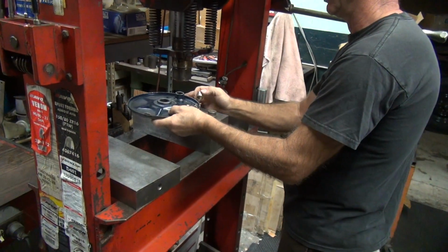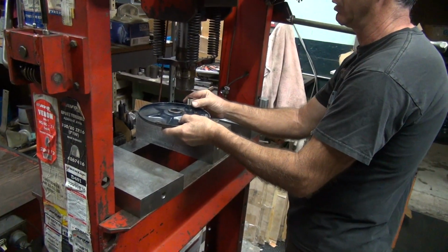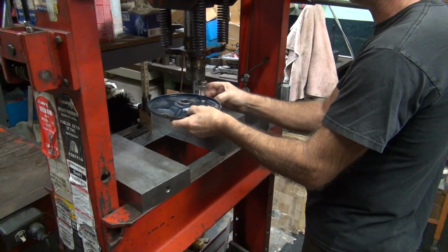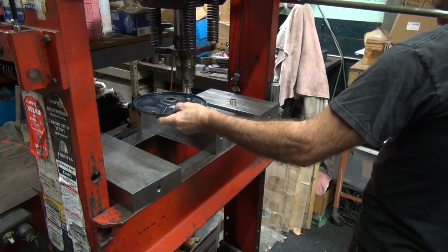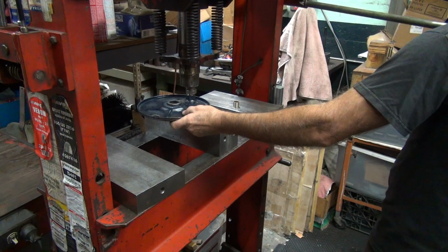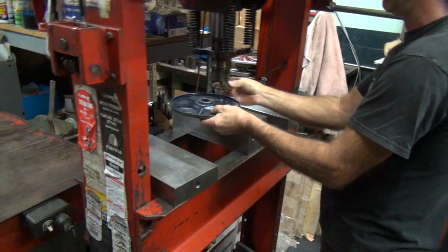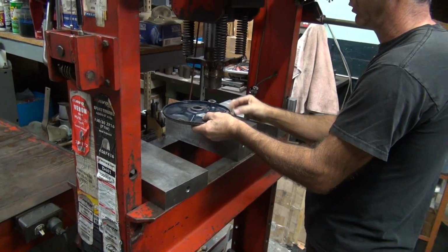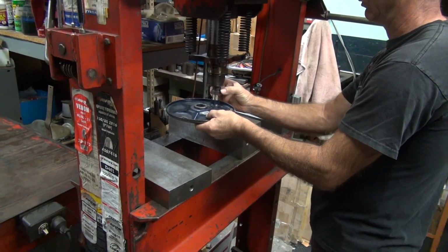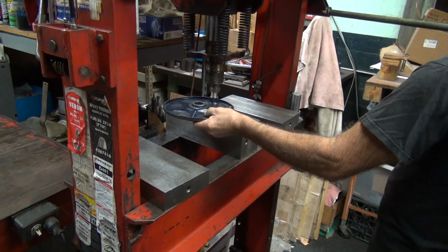Well, I think the groove belongs on the back side. I put it over here at the 45-degree point on the back side. I figure that'd be the best place to put the lack of bushing material. I wonder if my brake will feel a little smoother now. Return a little bit sharper. I won't need such a massive monster spring for it to return. Probably not.